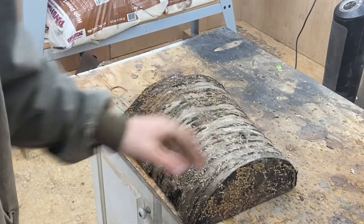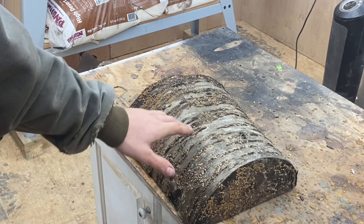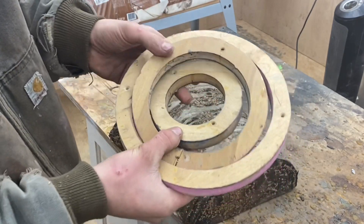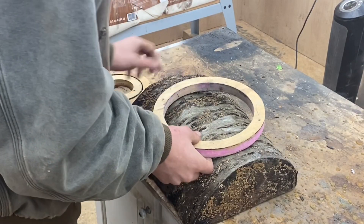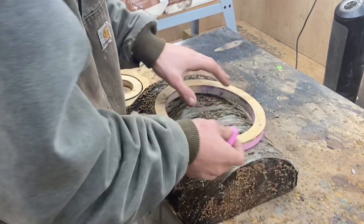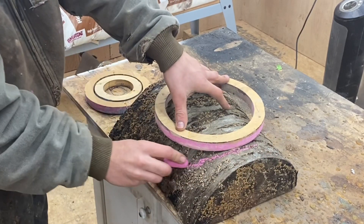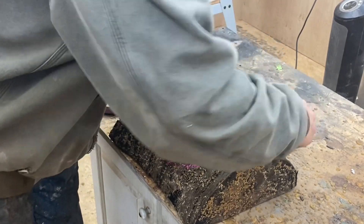What we've got up on the workbench here is a piece of wild cherry — about 10 inches across and 12 inches long. I've got this set of rings here that are perfect for marking circles out on a bolt. I'm going to find a ring that fits, and I like to use a piece of pink chalk because it stands out really well. I like to put the circle right in the middle because there's usually some checking on either end, unless I can get two smaller bowls out of it. Stick it right in the middle and just trace around that circle.